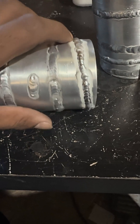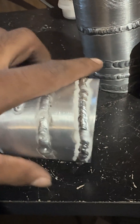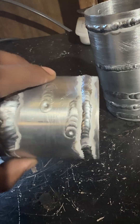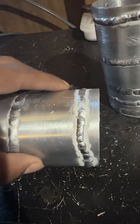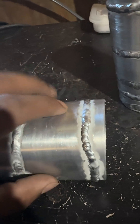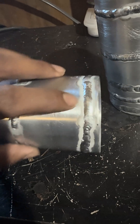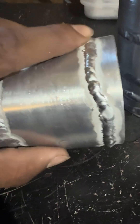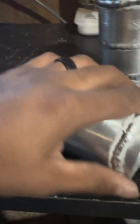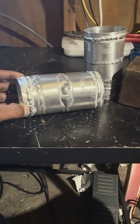After trying again, these are some of the results. I'm getting the profile that I want, but it's too blobby and sticking out too much. On the sides you're starting to see a little more dimes, but not fully there. The one thing I am happy about is being able to feed the wire a lot longer now — my stops and starts cover a bigger distance. I also got the profile I want with the lip. We just need to work on getting them straight and consistent. That's the next task. Thank you guys for following my progress.